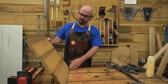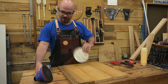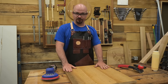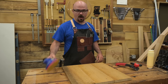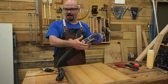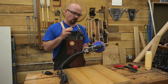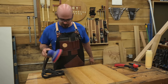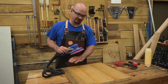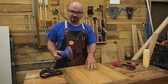Let's do some scraping and get some initial sanding done on this. It's pretty rough so I'm going to start with 80-grit paper — pretty aggressive, will smooth things out quickly. If your glue-up isn't perfect and it'll fit through your planer, you can do that. But you can also do it all with a sander. Whatever sander you have, if it has a dust port, hook it up to even a shop vac — it goes a long way in improving sanding performance. Without dust extraction, you collect a pile of dust under the pad, which builds up heat, dulls your paper faster, and you're just regrinding dust instead of cutting your surface.